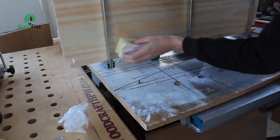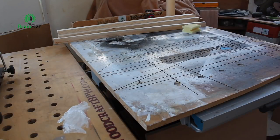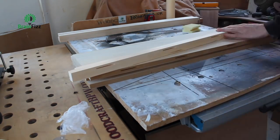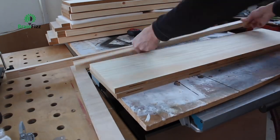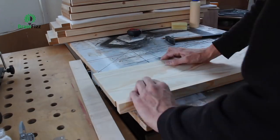Wipe off the glue carefully with a damp sponge. There's a lot of repetition work on this part, but it makes life a lot easier down the line. What I ended up doing was completing one bookcase of shelves, biscuiting them all together, and then gluing those up.